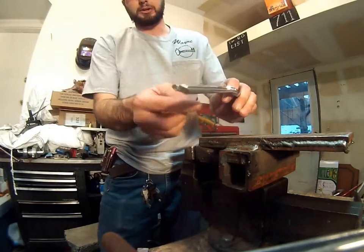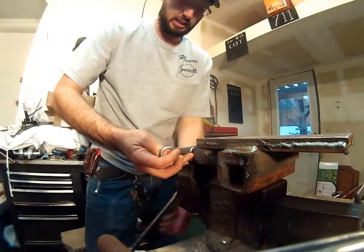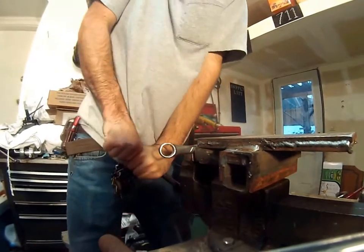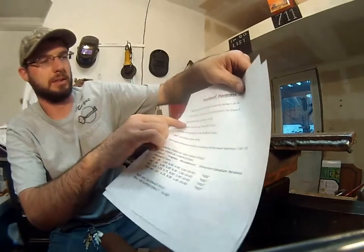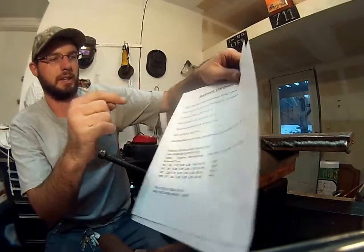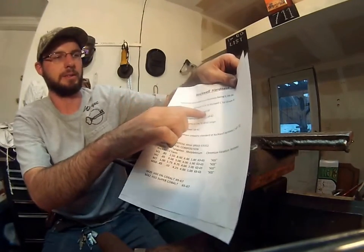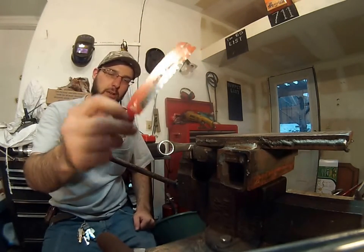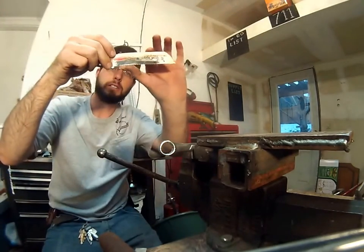Since we're starting to get to a little thicker piece of steel, I'm gonna go ahead and switch this around so we can keep everything fair and even. Now again, we're gonna be doing tool steel, high grade tool steel. We already cut this softer steel with the blade already, 3/4 inch right here. This is going to be your higher grade tool steel, 54 to 58 Rockwell hardness scale. So far, these have cut this steel, but they are pretty much trash by the time they're done, because the teeth are just about filed off of there.